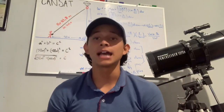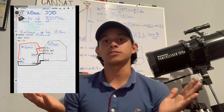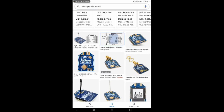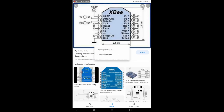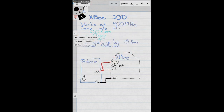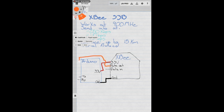For the communication, I have the XBee. You can see the connections in these parts. Now you can see the XBee Pro. I have the connections in the next image. The connection with the Arduino is simple: 3.3V with the 3.3V, GND with the GND, and data out with the TX. For the data in, you need to connect to the RX.